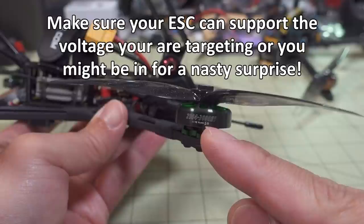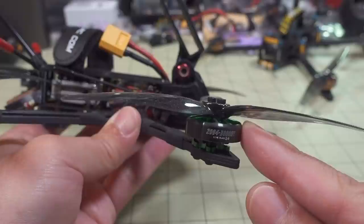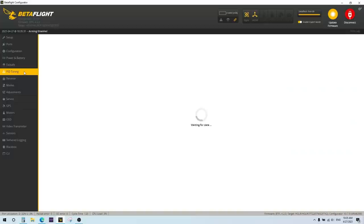You could probably run this on 6S if you wanted to. But if you want to run it on a lower KV on 4S and get more efficiency, that's what you can do. They're coming out with another version with a lower KV motor — I think 2600 KV. So if you happen to have something like this already and want to reduce your KV, you can just put in the lower value, either leaving cell count at 0 or setting it to cell count 4.